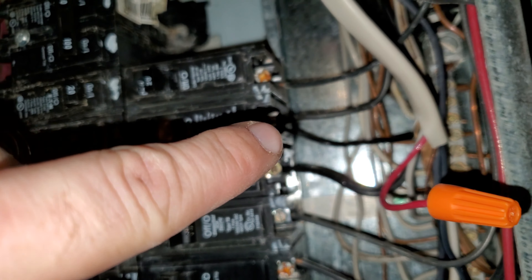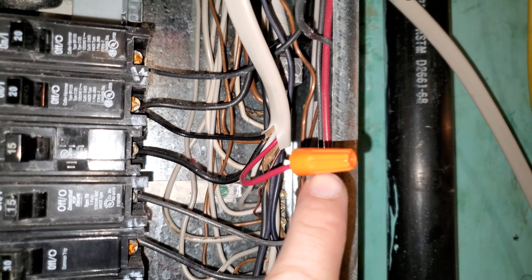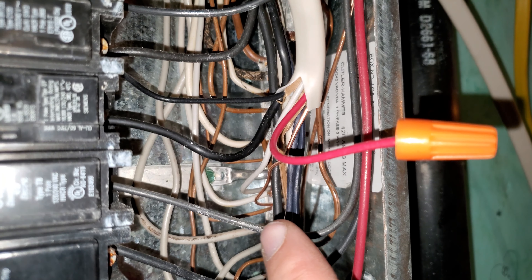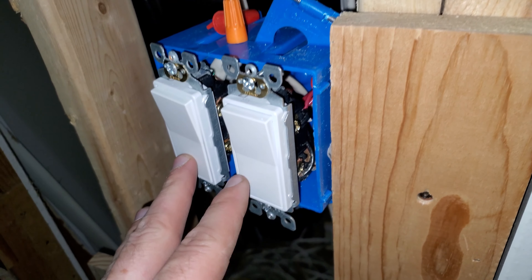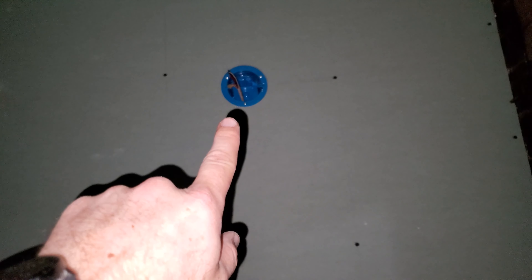So now I've got two wires back there going in. It's actually on right now, and I've got this one off out to the side, so I know it's that one. You can follow the white wire back there into that one, and the bare wire back there into that one. That is the ground that is taken outside to the ground. We've got the electricity coming up. That was the white wire here, coming up from the breaker, and we have these in the off position. The black wire here splits off and bridges these both — one is going to the vanity up there, and one is going up to the fan in the ceiling. So we're going to wire that right now.